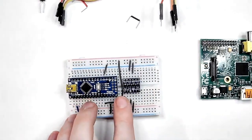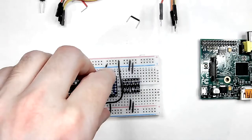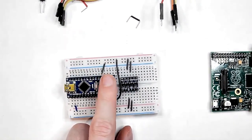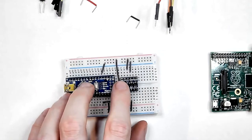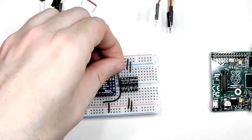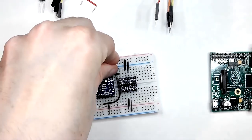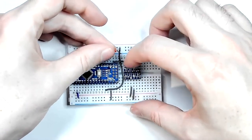The final connections are the TX and RX serial lines — this is how the Arduino Nano is going to talk to the Raspberry Pi video terminal. We need to pass these signals through the level shifter because they come out as 5V logic signals and must be dropped to 3.3V logic. To do that, we'll use the HV1 and HV2 channels: connect TX to HV1 using a small grey jumper, and connect RX to HV2 using the red jumper.